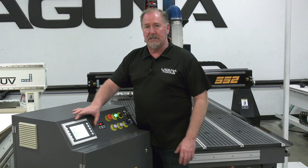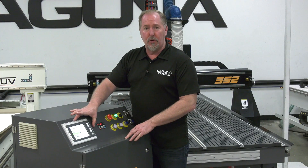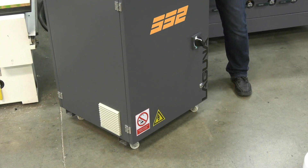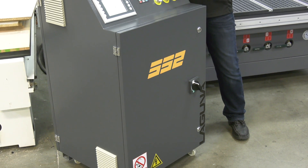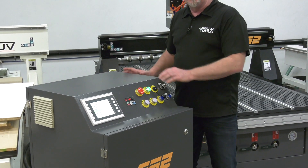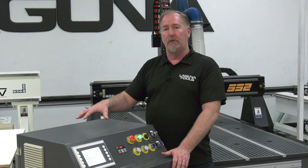One of the great things about B&R is that it's not just the controller you see on the outside of the cabinet — it's also the components inside the cabinet that are part of a matched package, including the drives, IOs, and other components, ensuring your machine operates very smoothly. Electronics are sensitive to dust and vibration, which is why we put all of the electronics in the control cabinet rather than mounting them to the side of the machine. We also put fans on the control cabinet to keep a steady stream of fresh air flowing through, maintaining the temperature and ensuring years of reliable service from your electronics.